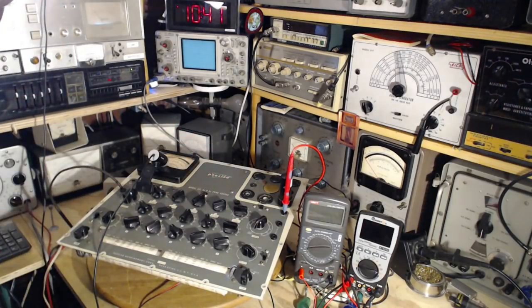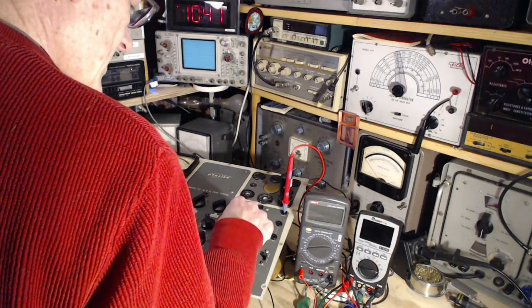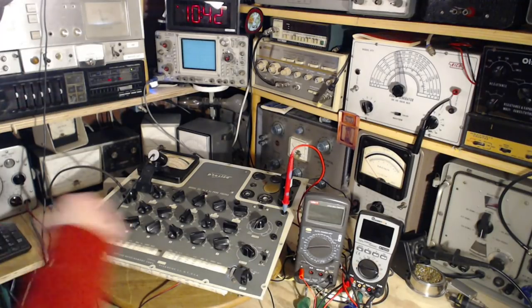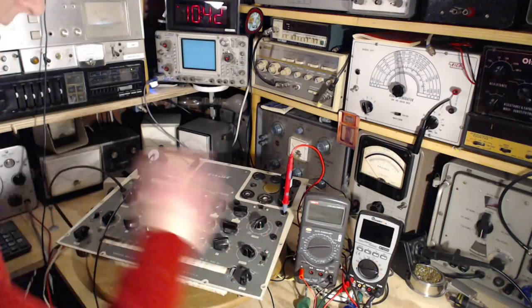The negative is supposed to go into the plate. Let me just see if I'm making a mistake right now. Just double check what it says here. Connect the negative side of the milli-ammeter to the plate jack - so that's plate. And the negative side is sitting right here. Just leave it there. EM shunt - did I set that? EM shunt to 9. Right. Yes. Okay, let's fire it up here.